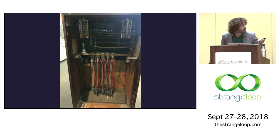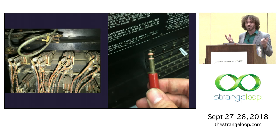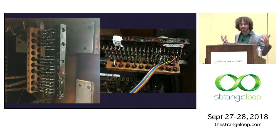The back was more of the same. Those big red and white things aren't cables — those are individual lead weights on each cable, so when you drop it in place, it immediately falls back exactly where it should go. Super satisfying. The ports on the front look like they should just be audio jacks, but there is this incredibly intimidating but amazing cable management. I've been told we don't know how to do this style of cable management anymore — it's something we've forgotten. There are beautiful pieces of string tying these rows in place and meticulously oiled wire. The cables are called Bantam — slightly differently shaped than quarter-inch audio jacks. You can see three contacts on the cable, like two data pins and a ground, and yet there are five pins coming out of the ports.